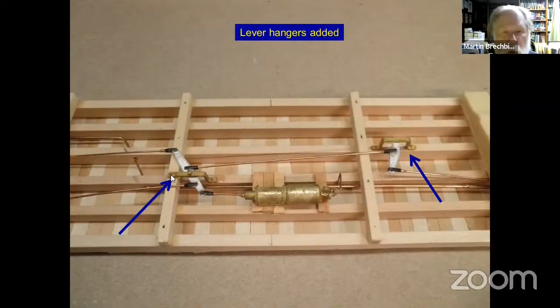Brake hanger. This one actually straddles over onto the needle beam, which sits right next to the queen post, but that sometimes happens because I should have moved this down just a little bit further. Oh, well, next time I'll get it right. It'll be close enough and no one will actually notice it, particularly after I put a coat of paint on it. Here's something else. You can drill out a little dimple on the back of these castings. And that's for hooking it into the train line.